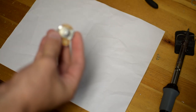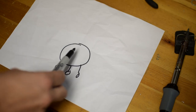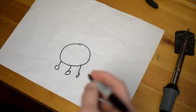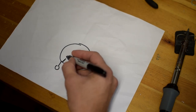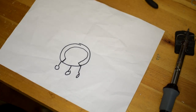To first understand how a potentiometer works, let's deconstruct it and look at what's going on on the inside. I'm going to use this as an example and draw what is going on inside. This is going to be our example potentiometer — you can see we've got the circle and the three terminals. Looking at the pot from the bottom side, each of these three contact points represents something going on inside. There is a connection point here and then a little circle that goes all the way around the pot and connects back over on the outer side.